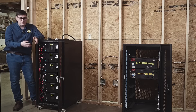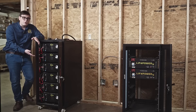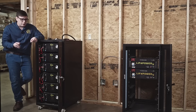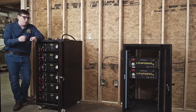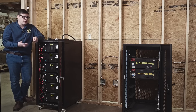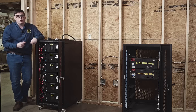The bus bar is about 400 amps capacity given it being three feet long — it's 150 square millimeters of solid copper. Each of the M8 connections is rated for up to 250 amps of continuous use, which is a 12-kilowatt inverter load. If you need more than that, consider either using more than one wire, or you can drill a hole in the bus bar and use your own mounting bolt.